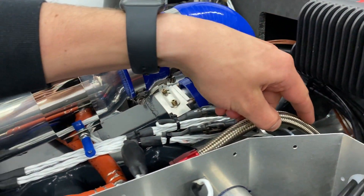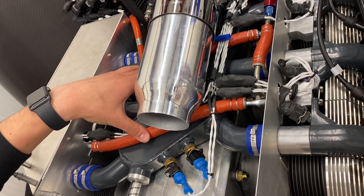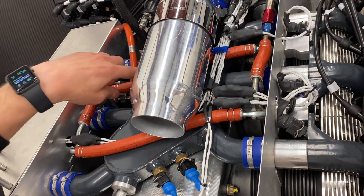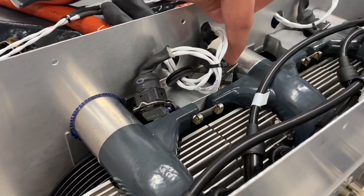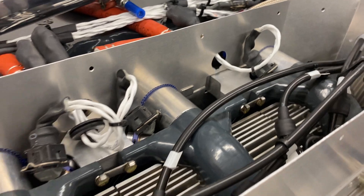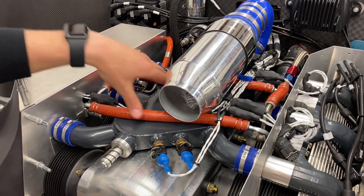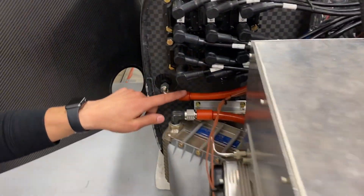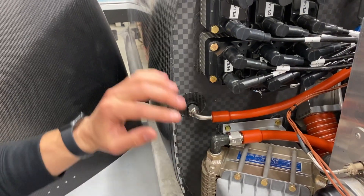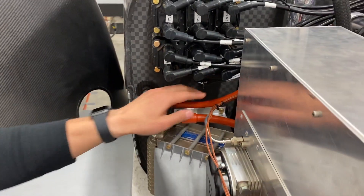This line is temporary right now for initial line sizing. It's going to come from the fuel filter up to this common high-pressure fuel rail, which is all these fuel lines that have fire sleeve on them. This all sits at basically the same pressure and then feeds the fuel injectors, which you can see on the tops of the cylinders — one fuel injector for each cylinder. Any fuel that's not used is dumped through the fuel pressure regulator, goes back through this return line to the fuel sump behind the firewall, and there's a check valve on the cold side of the firewall as well to prevent any backflow in the system.